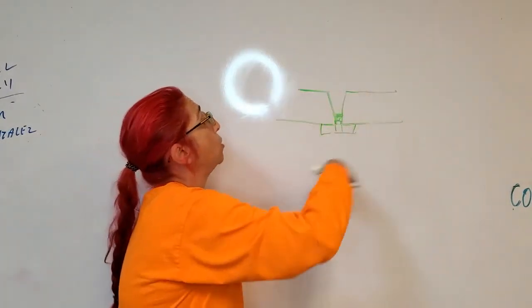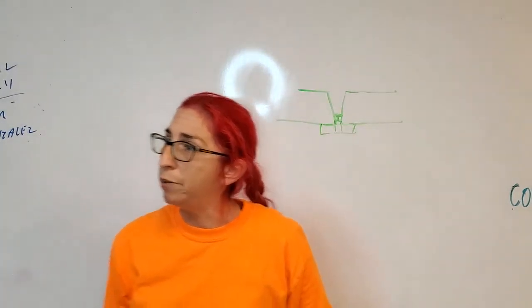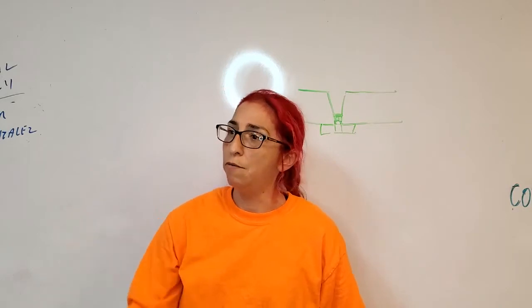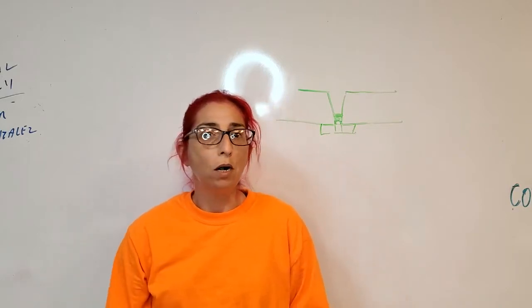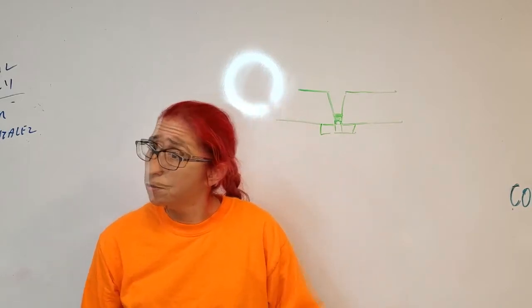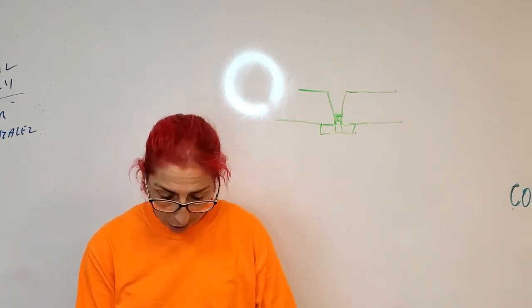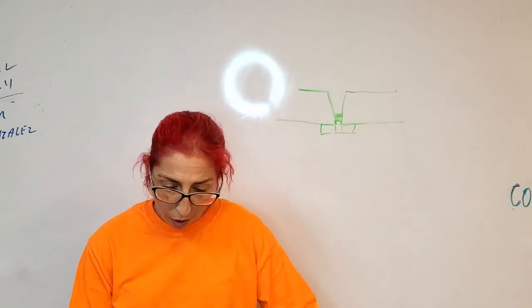If all of these things are as correct as can be and I'm not using enough heat, that may also mean that I don't have enough penetration, or I have incorrect angles. I'm not paying attention to my bead placement either, okay? So we need to make sure that we're really paying attention to that. I think we got the majority of the good stuff.